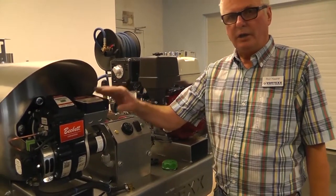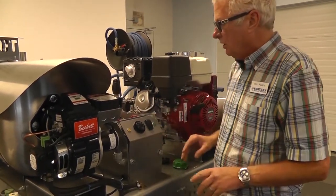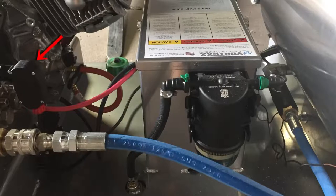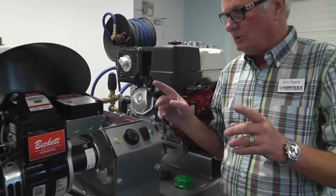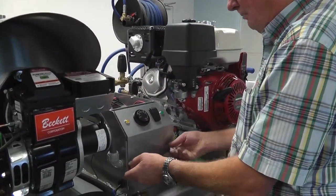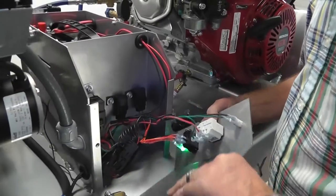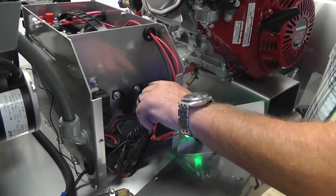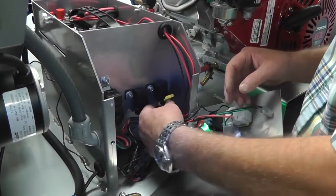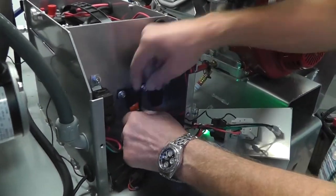If the burner is not starting and you've checked to make sure you have fuel, you have power, your battery's not dead, and everything's ready to go — what might be happening is your pressure switch, which is on the pump, and your flow switch, which goes through the water flowing to tell you there's flow and water pressure. If those both aren't switched on, this yellow light will not come on and the burner will not start. So we open up this wiring harness and check to make sure everything's hooked up. We have a fuse in here — I believe that is a 20 amp — and this is a 40 amp — so I'd start by checking your fuses.